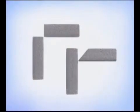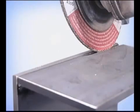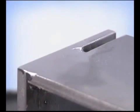Corner joints can be fit up several ways, depending on how you want the finished weld to look. One piece can be beveled to provide sufficient penetration. If the pieces were fit up without a bevel, use a grinder to groove the joint. For ornamental type projects, this type of fit up can be polished for a nice square corner.